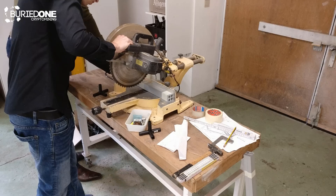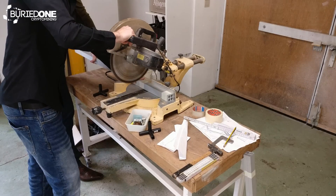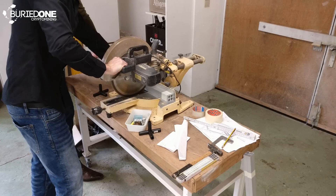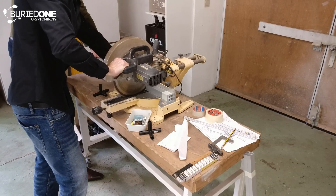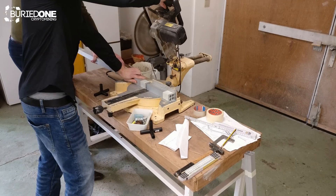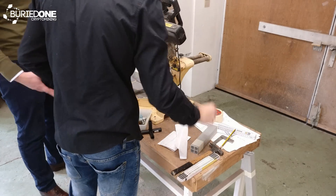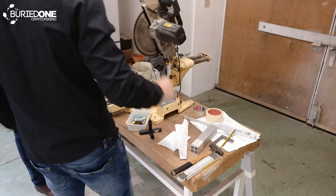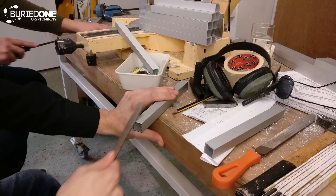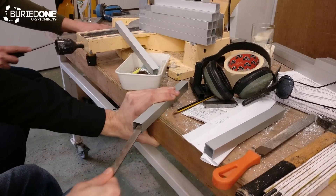As you've seen, we cut all the aluminum pieces with a normal saw. It's really important to have enough teeth on the saw, because otherwise it's going to create really bad, nasty chunks in the aluminum and it might shatter. So make sure if you're going to use aluminum that you do it safely. We also started filing the pieces down because the edges were really sharp and we didn't want anyone to cut their fingers.